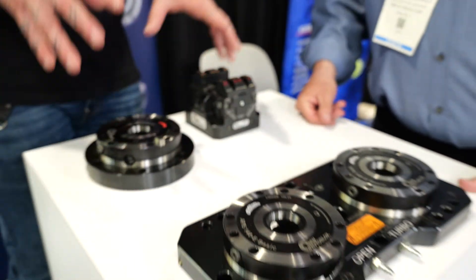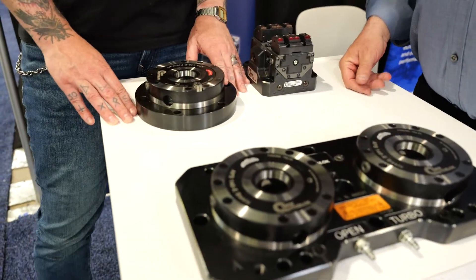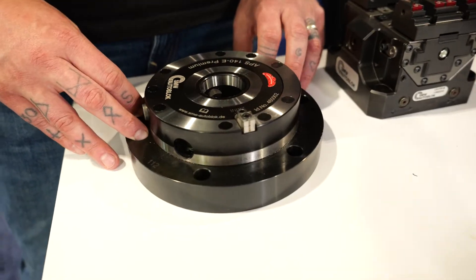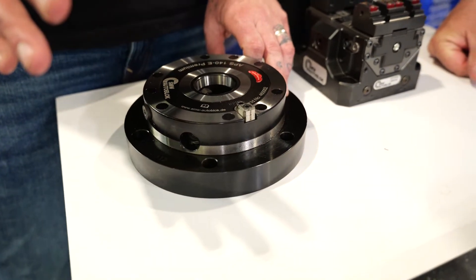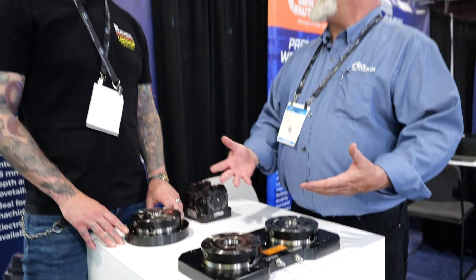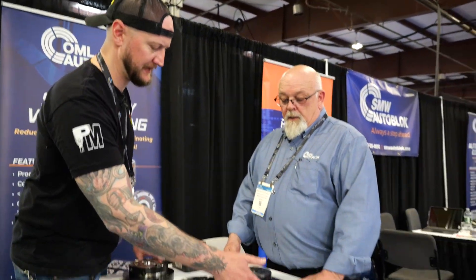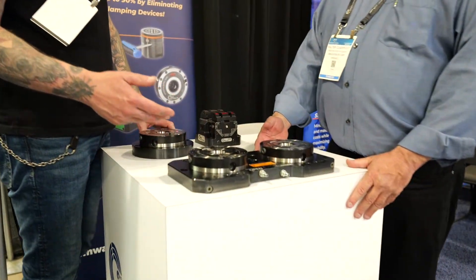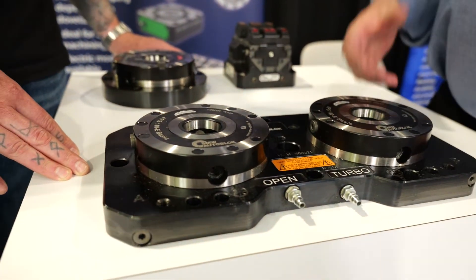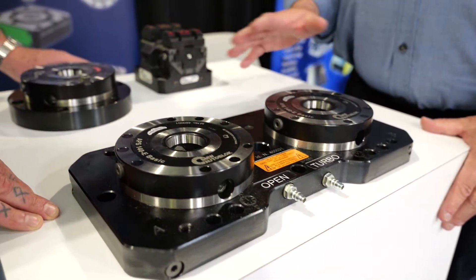When we're talking about the zero-point system, what's the repeatability on something like this? Five micron — two tenths for people that use inch. Your repeatability is going to be out of this world. So if you could take a fixture on and off your machine and not have to indicate it every time, that's the key to the whole production. These are pneumatically operated by air, but they're mechanically clamped — we use air to open them and turbo for extra clamping force. While they're in your machine, there's no air trapped in this mechanism, so you don't need constant air to use these.